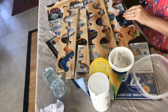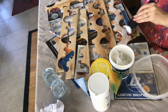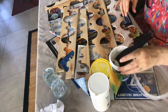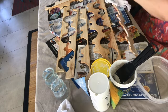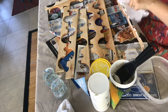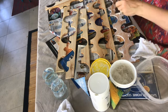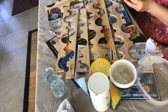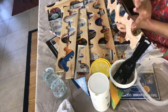Another super cool technique is to get a whitewash using grout. The pre-mixed grouts are great — you smudge them on, then use a scraper, plastic preferred, to gently get the grout back out. It remains in certain grooves and nicks in the wood to fill them. It gives a very dull, matte finish and fills in those gaps. Do remember to pre-treat the wood with water before you go this route. Because I didn't want to buy pre-mixed grout just for this test run, I'm actually using stucco, and it works better when watered down to a grout consistency.